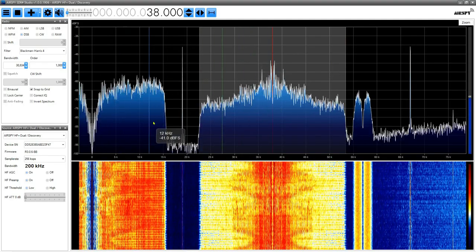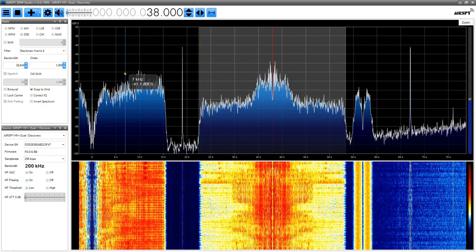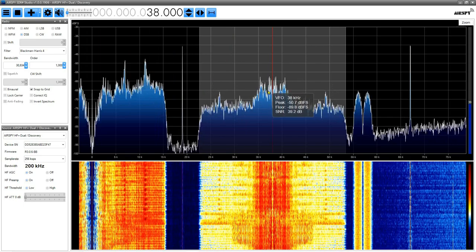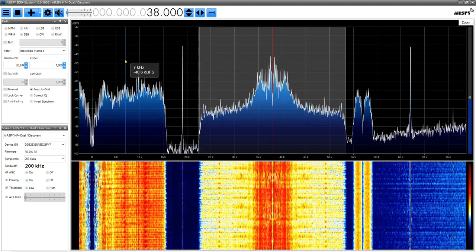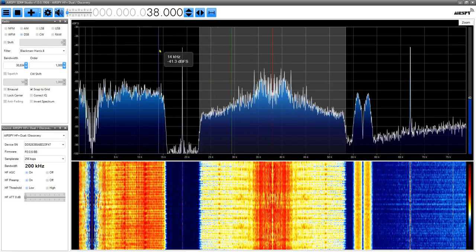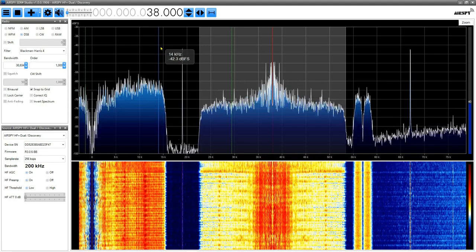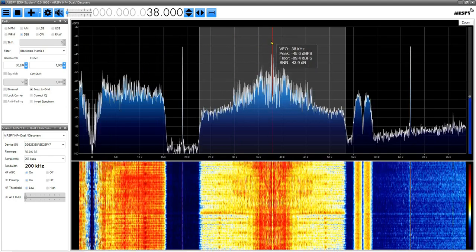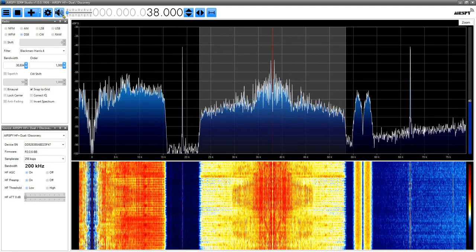This is left plus right. In other words, the two channels are added together here, so you come up with a mono signal, which is the left channel and the right channel. This is left minus right. So whatever the difference between the left and right channels is, you subtract those and you modulate them onto a carrier at 38 kilohertz. Okay, but it's a double sideband carrier and it sounds like crap.